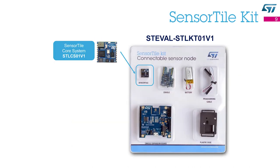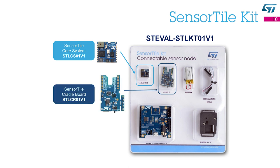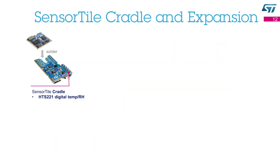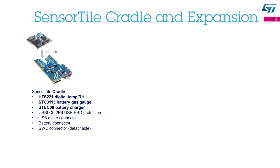The Sensor Tile is part of the Sensor Tile Kit. The Sensor Tile Kit includes two different motherboards that can extend its capabilities: the Sensor Tile cradle board and the Sensor Tile cradle expansion board. The first motherboard, the Sensor Tile cradle, is compact and includes additional sensors — in this case the ambient temperature and relative humidity sensor. It also includes the battery management circuits, a micro USB connector together with other connectors and an SD card slot. The SD card enables the local storage of all the data, removing the need to stream them out immediately.